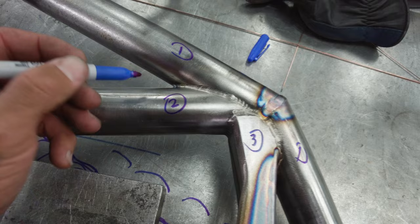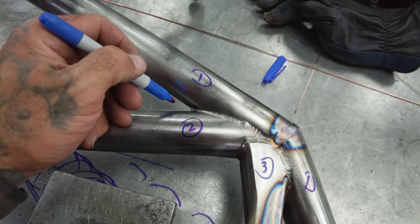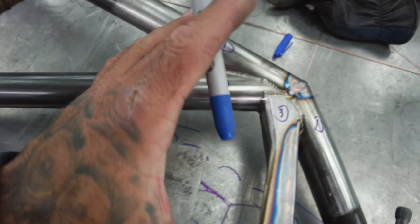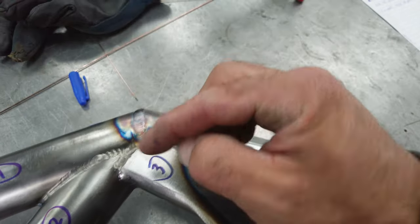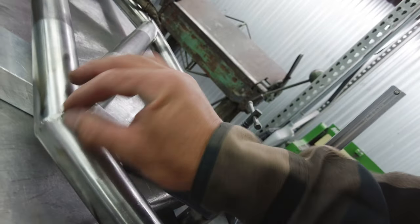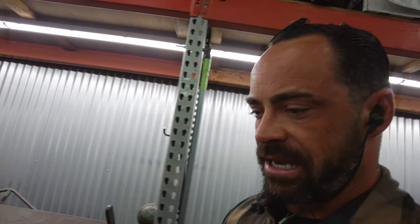Some people will weld, and this is totally based on your style and technique of how you want the aesthetics to look in the final. But some people will just weld whatever they want, but it doesn't really tell the story of the construction of the part. So we'll touch on that some more, but I have both sides of this plate work welded on the underside, and then I started to zip this, and then on the other side, on this guy, I started to zip from the other way because I just know the direction of how I need to weld is gonna be that way. So a lot of this is thinking about that process in advance and not welding too much or welding areas that are gonna compromise your final story of how that welding is.